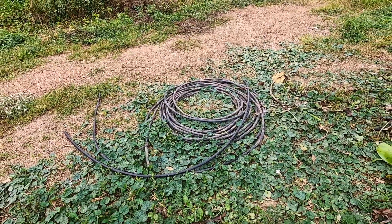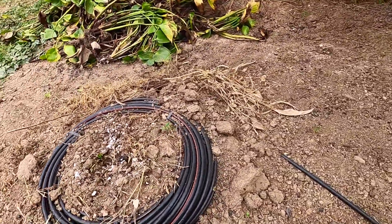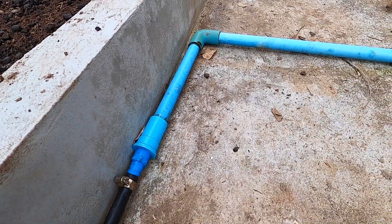We've uprated — we've got a brand new 100-metre hose pipe and Toon changed the attachments about four or five days ago. We haven't done the compost pile since then because we wanted to check for leaks. Previously on phase one we had one blockage — there was a little bit of swarf in the blue pipes we'd cut, and when we opened the valve it flushed through and clogged up the back of the shower head. The system itself was fine right up until the water temperature started tailing off, about six months.